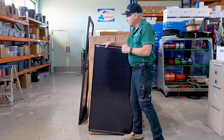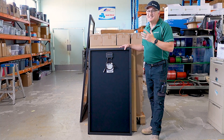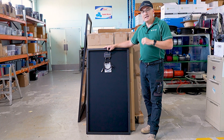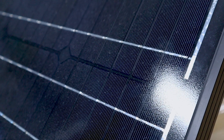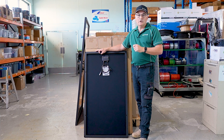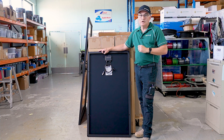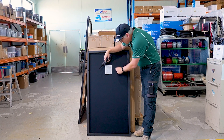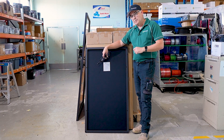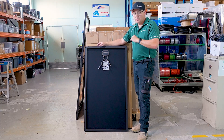One of the other major things that sets the Volta apart from a lot of other brands is their voltage. They've got a really high voltage for a 12 volt solar panel, which is a massive advantage when you're wiring up your solar panels. We see so often people struggling with voltage drop, so they don't get the performance out of their panel because they're not producing high enough voltage. The Volta open circuit voltage is 23.3 volts, which is very high for a 12 volt panel — that's a major, major benefit of the Volta range. They've all got a very high voltage.